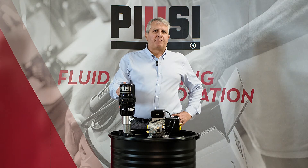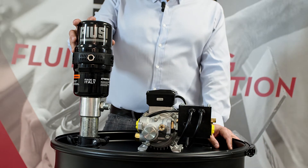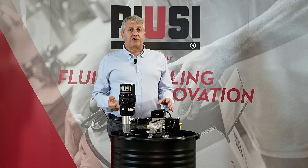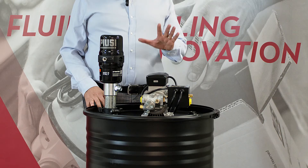Choosing to use a piston pump requires having both electric power and a running air compressor with compressed air to run the pumping system. This means a double transformation of energy is required to run the system, while this is not required with an electric pump.